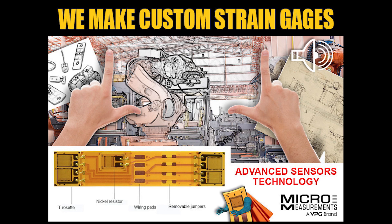Are there any other features that we can add to a custom gauge? Really, the number of options is limitless — it comes down to how ingenious our customers can be. On the stress analysis side, a lot of customers are looking to add things like lead wires to the strain gauges to minimize effort, especially in the field. With transducers, it's usually more about how to eliminate labor — can I put down one backing with multiple grids instead of individual gauges to help streamline the process? We basically have a whole range of both of those that we provide to customers.